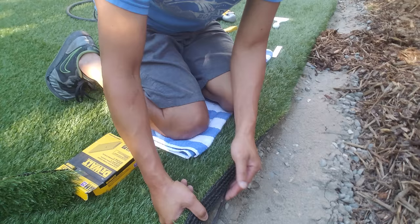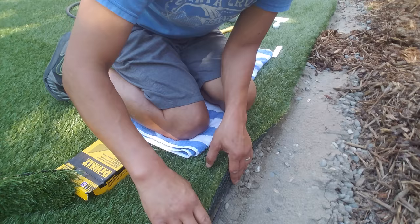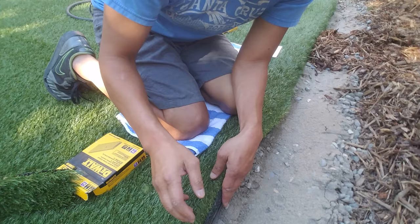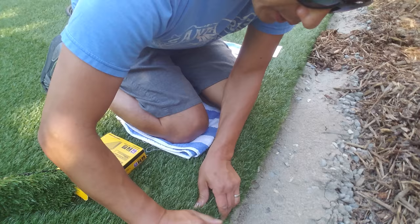Inside the retainer there are places where you can stake down the border. I put these section stakes in about every foot, then I brought in material — gravel and sand — and packed it all down. If you look under here it looks like a putting green, absolutely smooth and perfect. So the first step is to get this plastic retainer wall built up and tacked down, because then when you're ready to lay the grass, you'll lap it over just like this and staple it in.